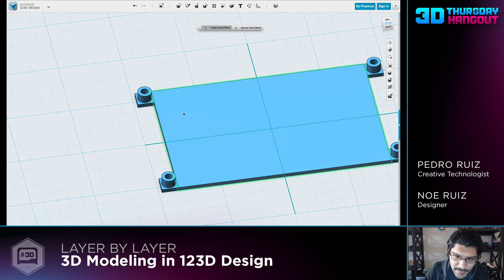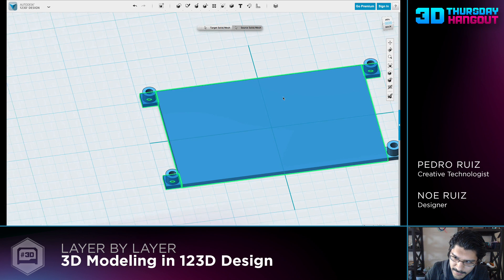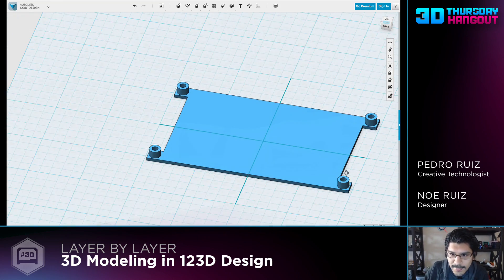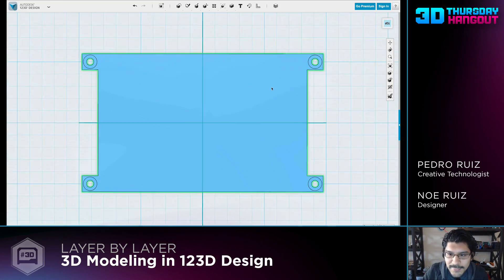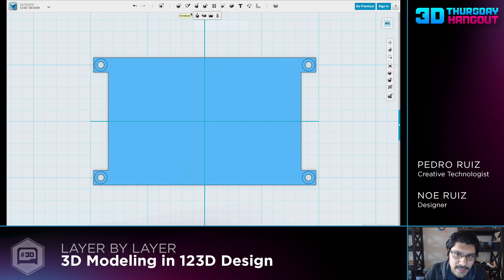The last thing we'll do here is merge the main PCB with all the little tabs. Just like that, hit enter, now we have our shape. The next thing we'll want to do is make our screen - the actual display. You'll have to measure this out; it's not listed in the tech drawing, so you definitely need to use a caliper if you're doing a different component.